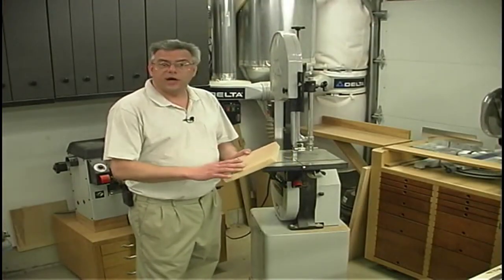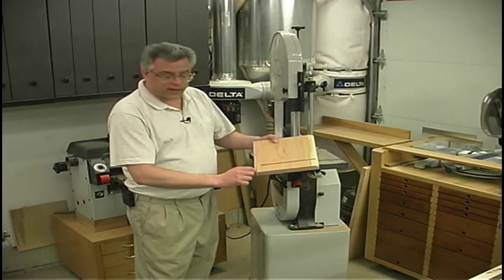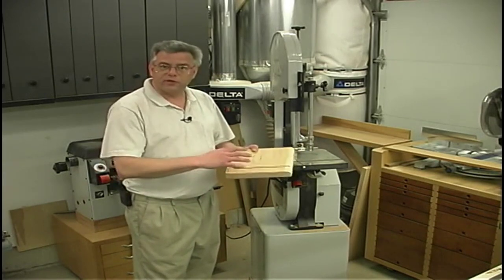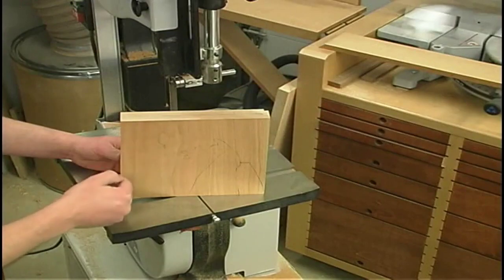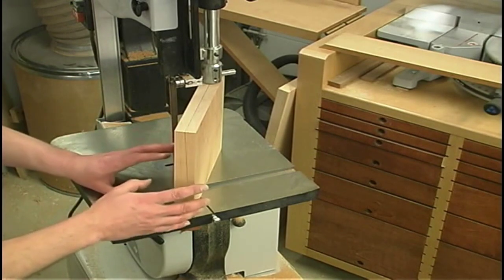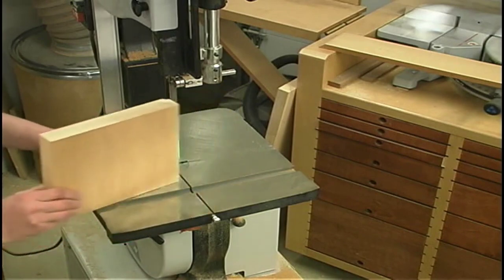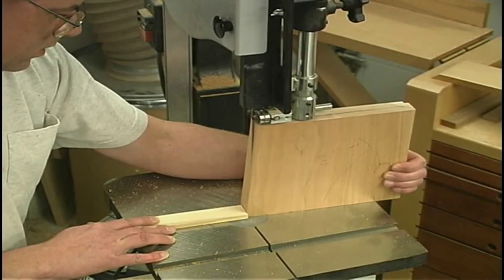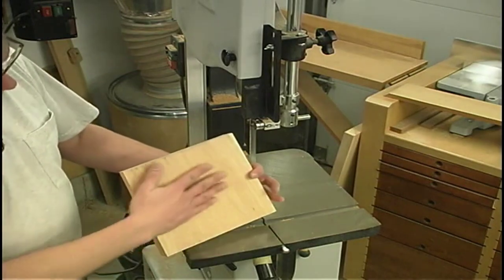Now that we've got all of our precision machining done on our legs, we can start creating the freeform shape. We'll start out by cutting the taper along the front edge of the legs. You could do that at the table saw, with the jigsaw, bandsaw, or even a scroll saw — it doesn't have to be perfect because we're going to be blending that in with the belt sander. Now that our leg has the bell-bottom shape at the front, we need to cut away on the side area here too. After doing the layout on the workpiece, tilt your bandsaw table over at about two and a half degrees and line it up with your layout marks. Now we have the bell-bottom shape along the outside edge.